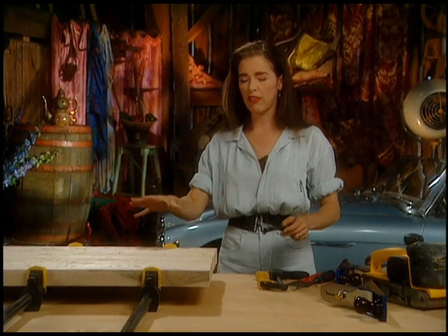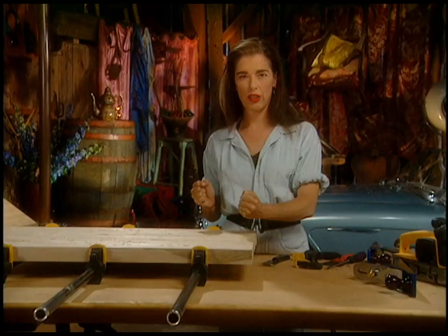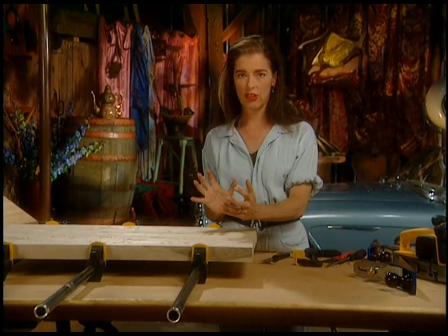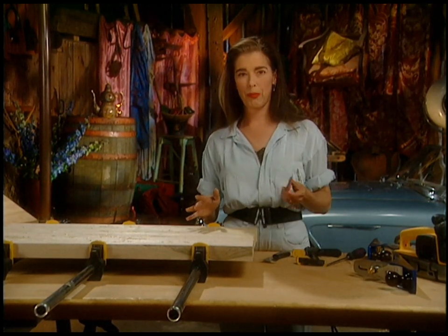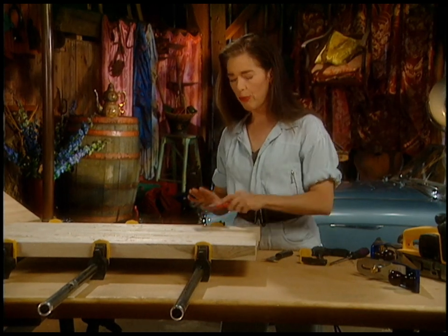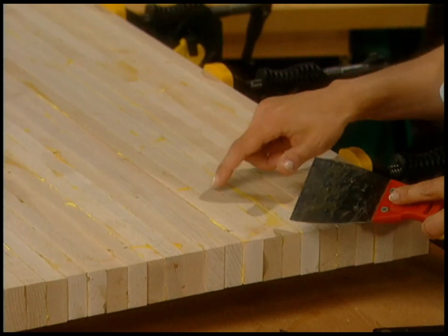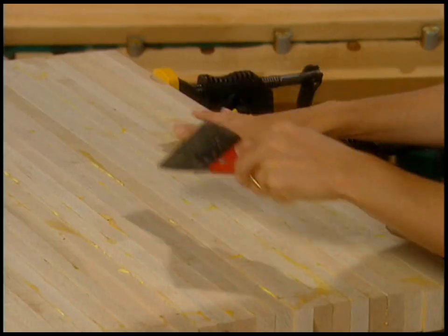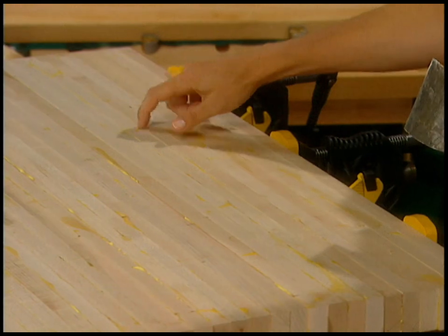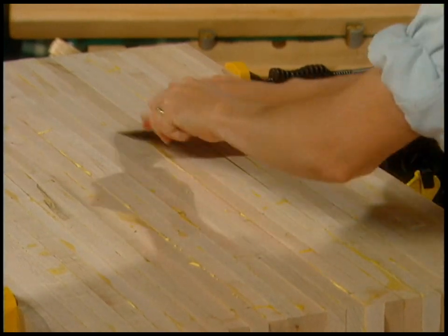These babies are glued. The five clumps of five are glued. I've got 25 boards here, and I used my big bar clamps because they have the most torque — well, it's not really torque, it's just pressure. I'm going to take this out and use a putty knife, the same one that I glued with, to scrape off the excess glue. After about 20 minutes you can really work with it easily. But I should have done that on all these clumps as I was gluing them instead of wandering around thinking I had idle time. Because now the glue is so set up in spots — it's really hard — so I can't get it off easily. But these new runs I can; it just kind of curls up and peels out, which is nice when it's still soft.